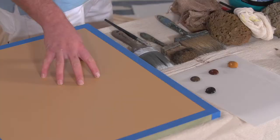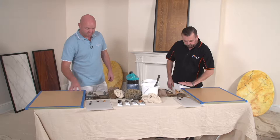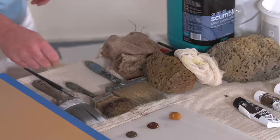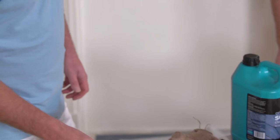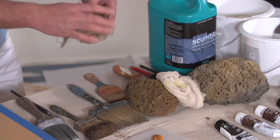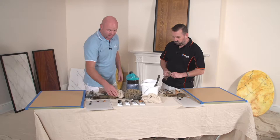Thank you Barry. We've got a background of an eggshell background OHC 35 and it's an acrylic finish on top of MDF and we just put some tape around the perimeter to frame our work. We're going to use tools we've used before, plus a few new ones. We'll use a Lucas brush to apply the scumble glaze, a badger softener, a hog hair softener, and hessian — sometimes known as burlap — and then there's a check roller we'll be using later on.